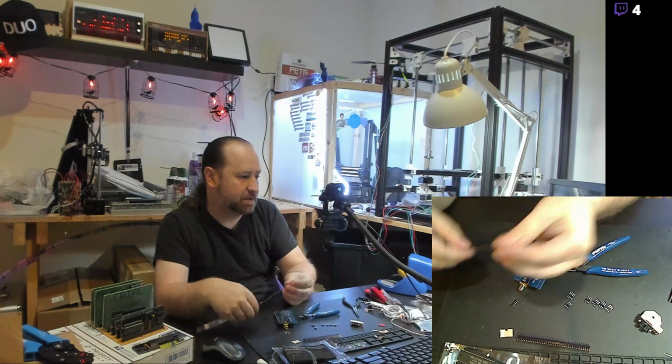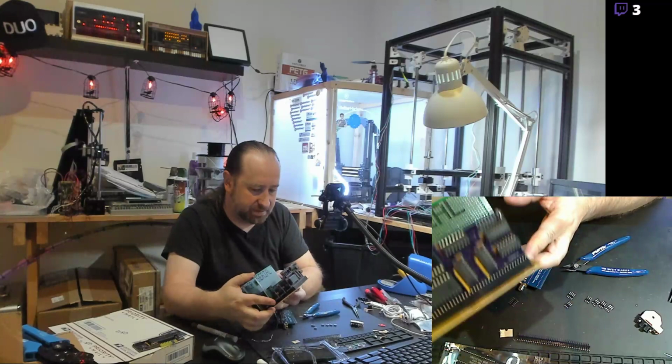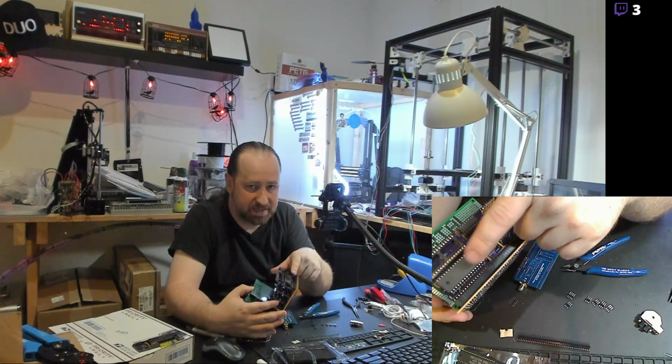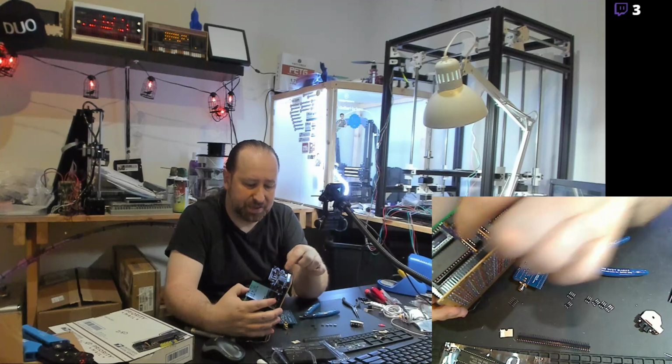So it's not the typical Windows OS once it's done. No, actually, the RAM and ROM board that's on it, this is one of the RAM ROM boards that I have. And that's a RAM chip there, 512 kilobytes, half a megabyte of actual RAM. And that's just its total working RAM. It can't actually access all 512K at one time. It can only do it in like 32K chunks. The empty slot just above it here is for the ROM.